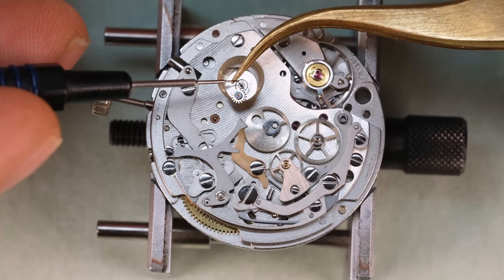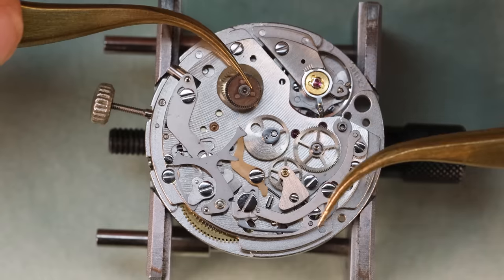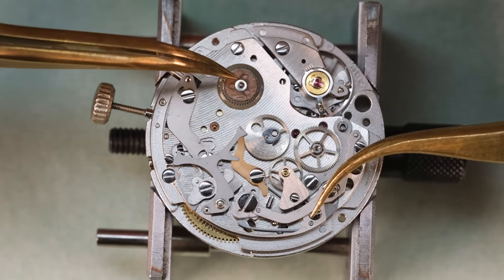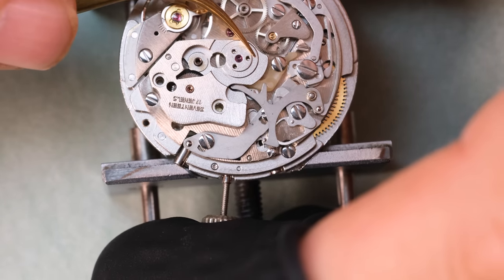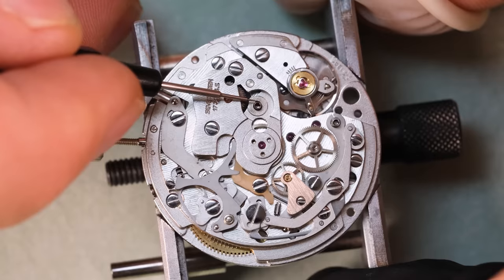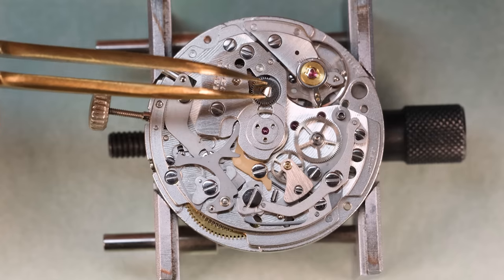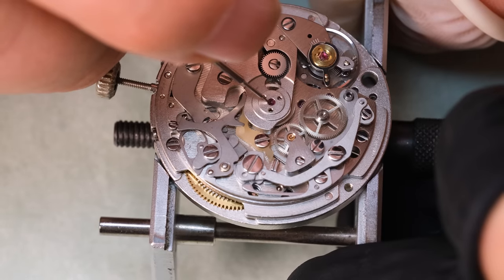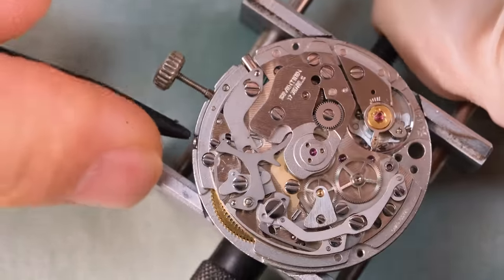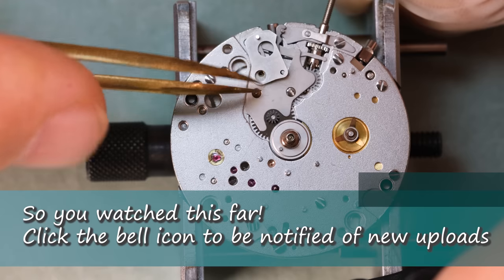I mentioned this movement has a few quirks, and the automatic winding is one of them — it's a bit over-engineered with a couple of tiny satellite wheels engaging each other, plus a plastic ring with teeth that's not entirely future-proof. With all the chronograph parts on the train side back together, let's check the functions. We remember the operating lever wasn't really snapping back, and now we see it does — so that's good to see. Let's then turn the movement over to the dial side.